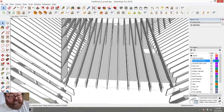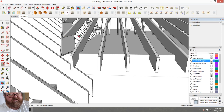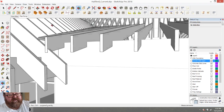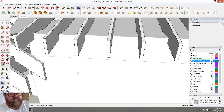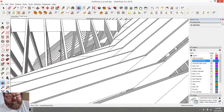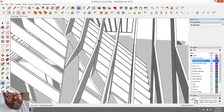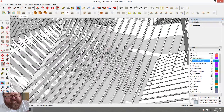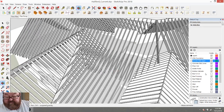Okay, and then you would line up this 2x12 or whatever, a wide enough board so that this long cut here will sit on it. Then you'll pop your line where that lines up, so that when your decking runs across it's lined up that way, and also up here. See, just really what you're trying to do is get it all on the same plane. That's all you're trying to do. And then you'll keep your rafters at 16 inches on center. And right now I'm just showing these sitting on top of these other ones. You could, let me turn the second floor.